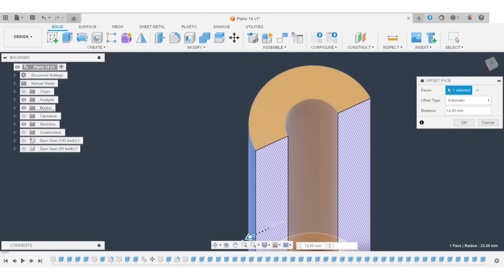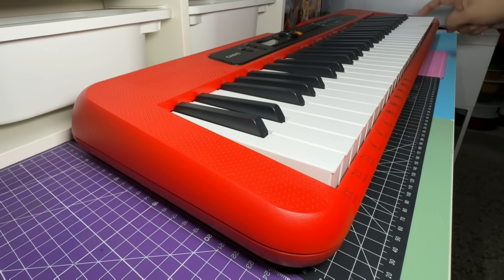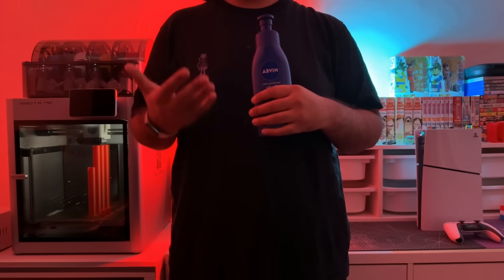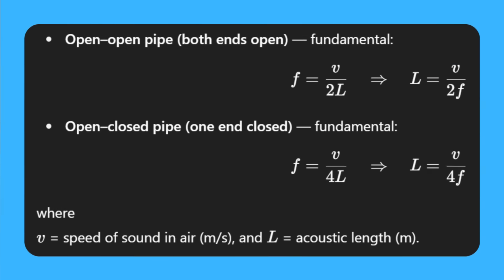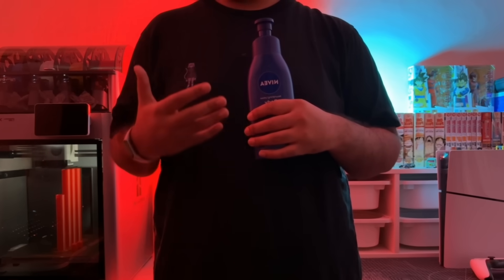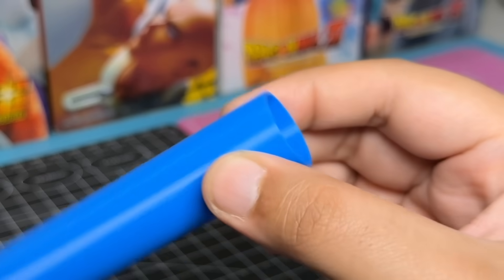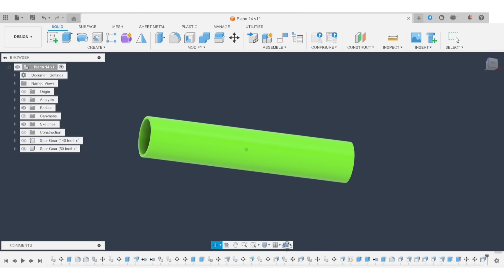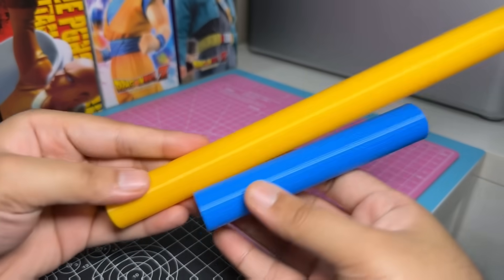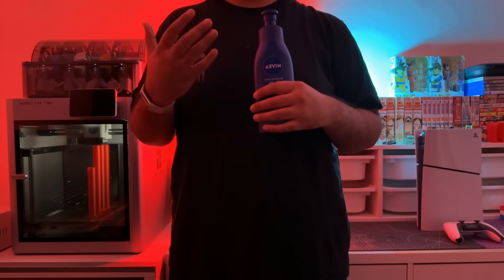After this we need to refine these pipes to make them as loud and clear as possible, then choose an octave that works best with our space and material constraints. I found a simple formula that tells me how long each pipe should be for a given musical note, but we have a choice: do we make both ends of the pipe open, or go for an open-closed configuration? With both ends open we get a slightly louder sound, but we'd have to make the pipes twice as long as we would for the open-closed configuration.